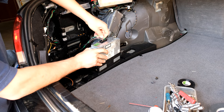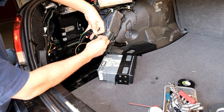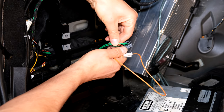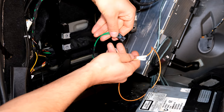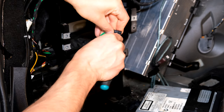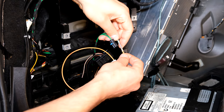Since this works in a ring, all you need to do is remove the connector and align the sending and receiving fiber optics so the signal sends back around the loop. You should see it flashing red — that's telling me there's a problem. You can open this over here, there's a little clip on the side — open it with your nail, and there are the send and receive. You can also depress this one and it pops out at the back, then lift — there's a little clip there and the fiber can come out. Get both out and you can bypass other modules or just align these two together using heat shrink.